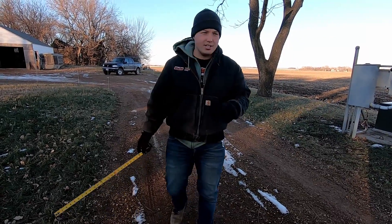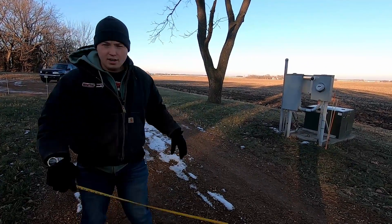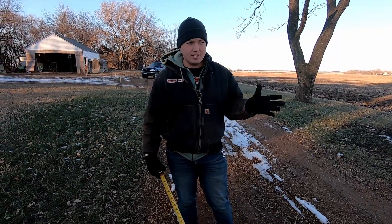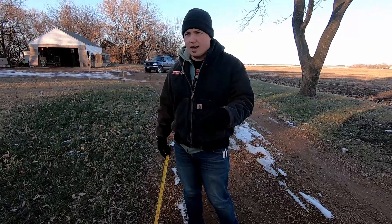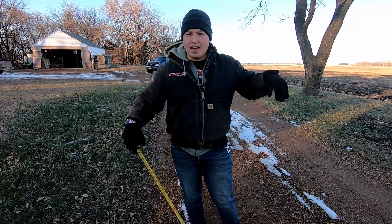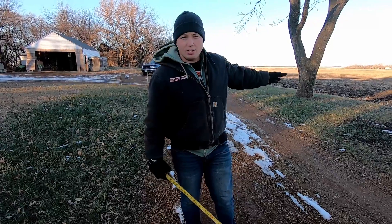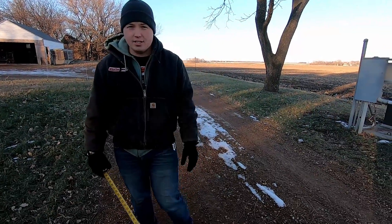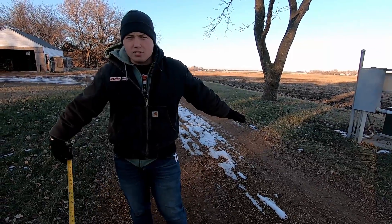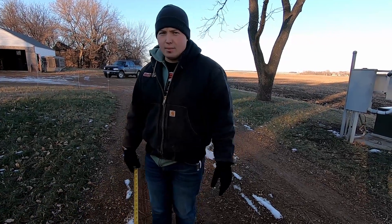I actually used to have my propane tank right over here, and when I dug that original line over to my house I dug it down at four feet deep. I had a backhoe here, but also if you put the line deep enough — for instance, if you know you're going to be running electrical circuits where you'll be trenching down to 18 inches for electrical lines — it's a good idea to dig it extra deep so it's out of the way and you won't inadvertently clip it off.